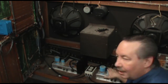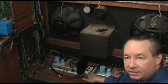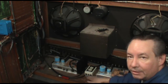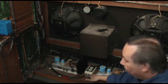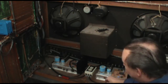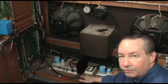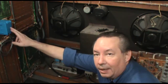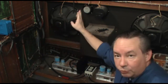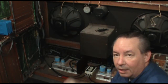So I can set these up right here, and to do that, I've put in this additional electrical outlet. So we have a brand new power cord coming in from the wall. Then we have a line wired in to go to the main power supply, and that's the normal way things are set up. Then I have an additional line which goes over here to my box for my additional outlets, and those are switched. There's an additional switch run in to switch those from the console.